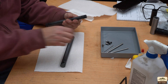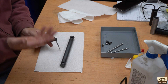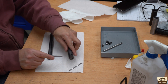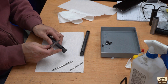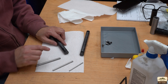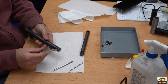Let's look at how the high-speed steel bits fit. The eighth-inch is a nice snug fit — you never know if the metal will move from the heat treating process, but this one worked out great. The three-sixteenth-inch is also a good fit on both bars. I did run into a little bit of a problem with the quarter-inch — it was really tight and I had to tap it in with a mallet, which is too tight. So I used a quarter-inch high-speed steel end mill in a handheld drill and lightly worked it through, and things loosened up pretty well. It's tight but you can do it by hand, so it's perfect.